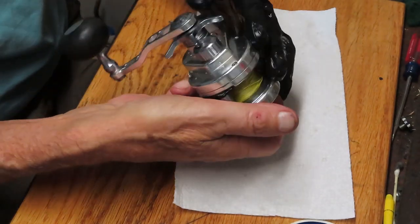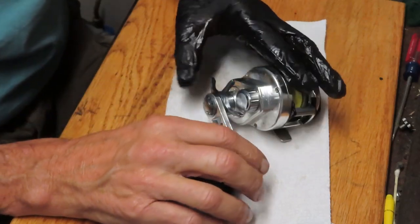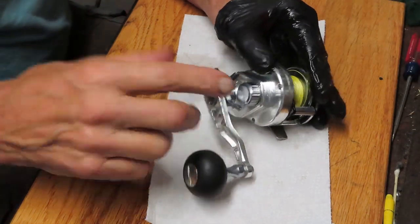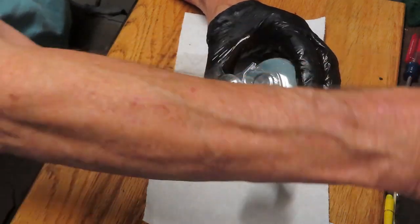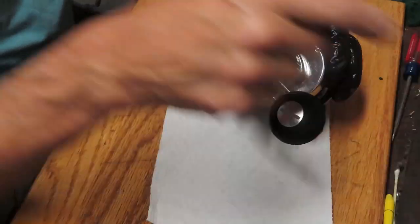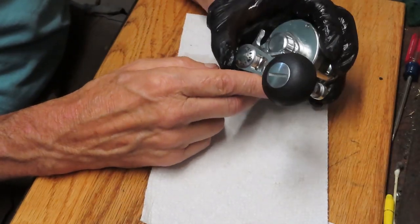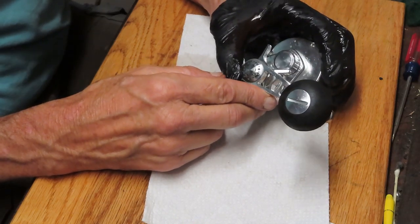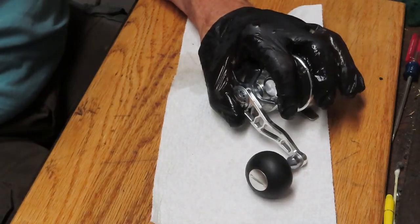The other one seems to be completely frozen, and I tried to test a couple of things. I found out that all these screws are pretty much locked in place. So we had to do a penetrating oil bath on all those screw heads before we even started. Now we can show it to you without taking 15 minutes to free those screws up. I just let the penetrating oil do the work — went and took a little break and now we're back.